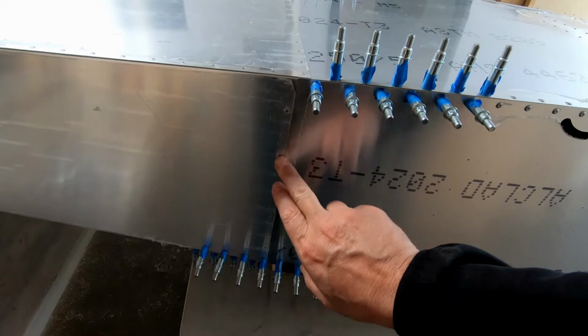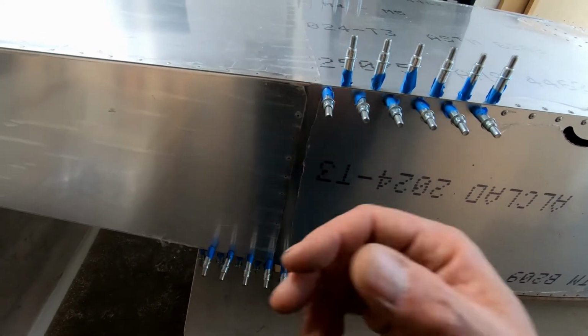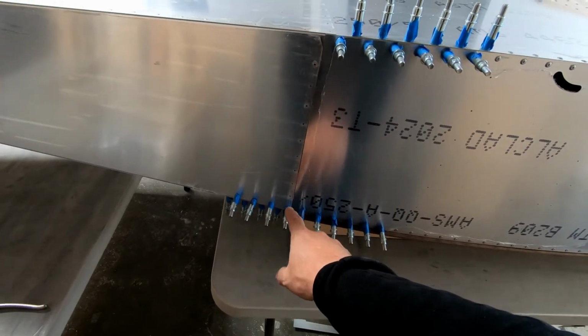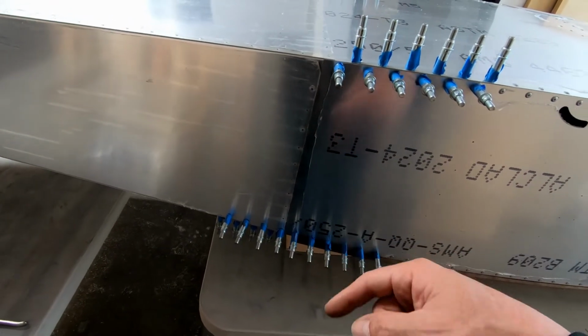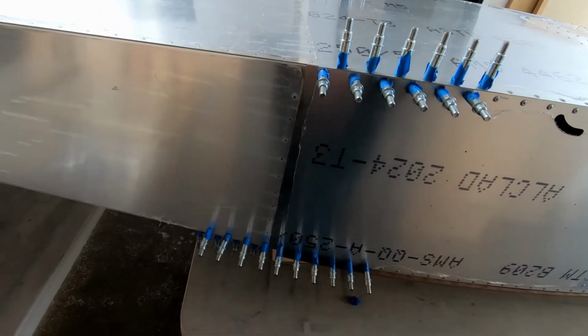When I attach this before to the rear fuselage skin, it fits with the front and it's not pulling it in or pushing it out, so that seems good. However, I think I do have an issue on the top of frame 7, which I'm not going to talk about here. I'm going to mention that after I get frame 7 installed, and I'll show you the issue that I believe I'm going to have, and I'll show you how I'm going to fix that.